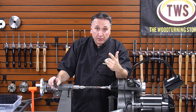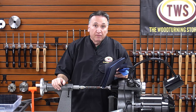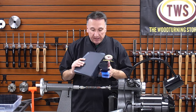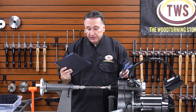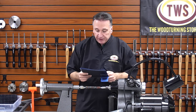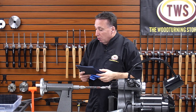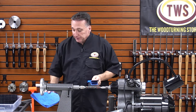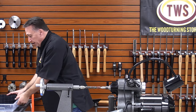The system I've come up with for sanding and polishing acrylic blanks uses wet-dry sandpaper — typically what you'd find in the automotive industry. We sell this as a Hurricane product, made for us in Sweden. We offer it in full-size sheets which I've cut down to strips about as wide as a pen kit, and also in three-inch round discs. I'm a real stickler about keeping this American Beauty lathe clean.